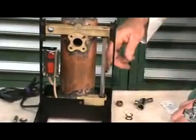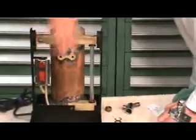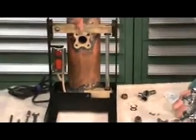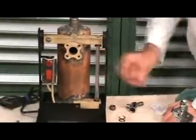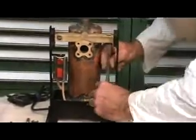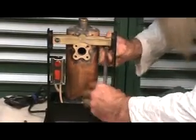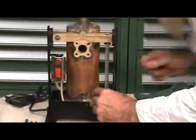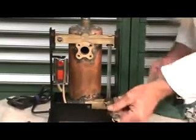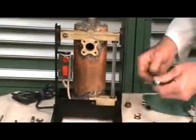Now the beauty of this is that if you get that stripe in the wrong place, when you put your front plate on and it's all crooked and you can't see the blue stripe because you put it in crooked, you can, with these silicone seals, just loosen these things up and move it around, and you can correct that mistake. So you make sure it's pushed all the way down, which it is. You align just visually by right angles. To me that looks straight. Now you take whatever 17mm wrench, whoops, that one came out of its start, and you go ahead, tighten these down.